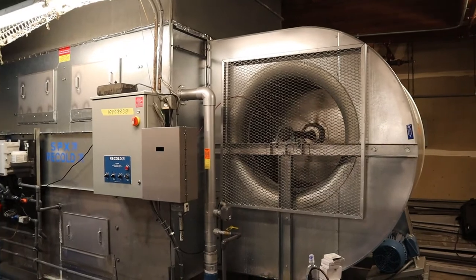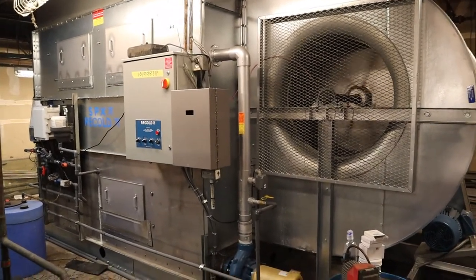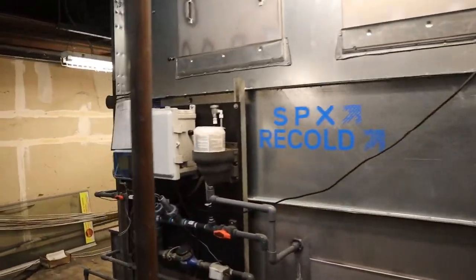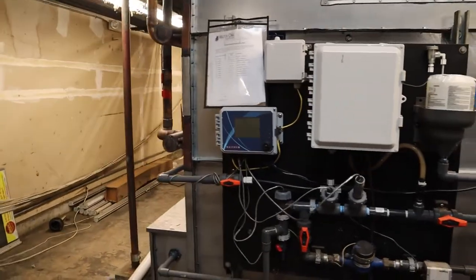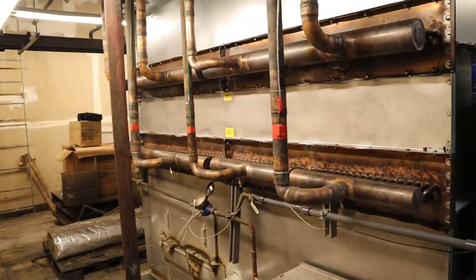But there's a lot of programming behind that. It takes some time. You got to do combiners and the wet bulb calculation. You got to put the bypass in there. There's a lot of interlocks in there so both contactors won't pull in. Because like I said earlier, if they both pull in at the same time, it's going to blow up. It's a lot of programming.